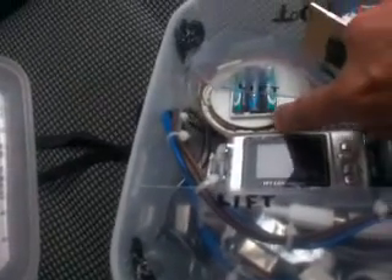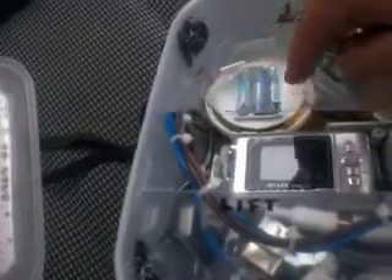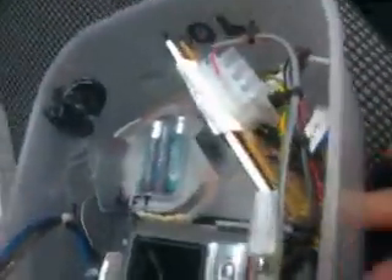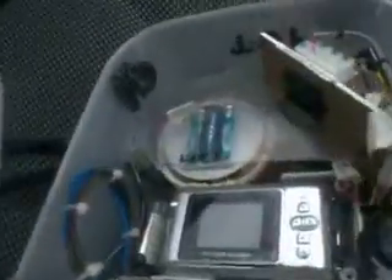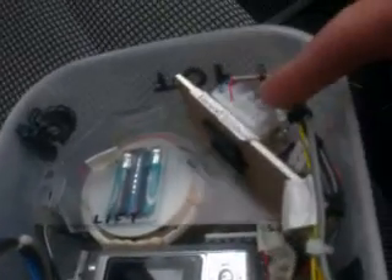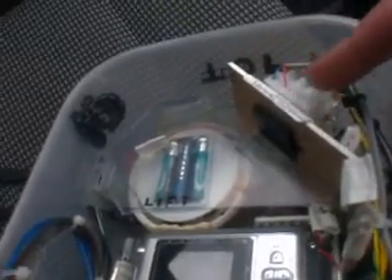This is a £10 PIR with built-in LEDs at the front. I've disconnected the LEDs. It runs on three batteries. One of the LEDs goes to a transistor at the side of it — you probably can't see it, but there is a transistor there. The transistor is connected to a relay. When the PIR triggers, the LED comes on, triggers the transistor and energises the relay, which is powered by 12-volt.